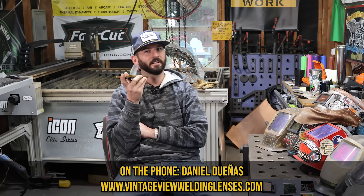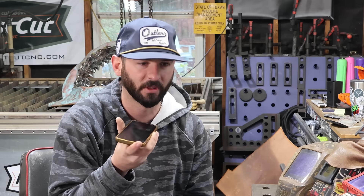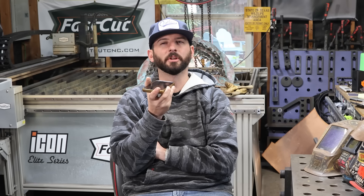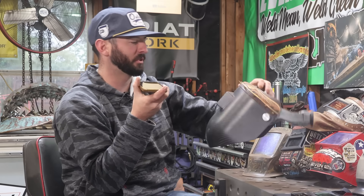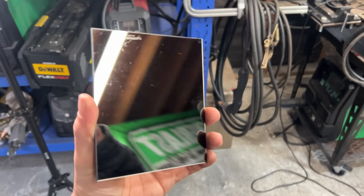Daniel, I'm making a YouTube video on welding hoods. What defines the difference between one of the gold glass lenses you can get for 20 bucks versus a more high-quality lens and the colors that go with it? When welding lenses are made, they're made with one solid color — so when you're welding with a green lens, that's the only color visible light let into that glass. With the Levi blue, you can still see some reds and some greens. So different colors really come down to preference. The black dahlia is my personal favorite or the AO classic.